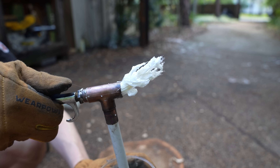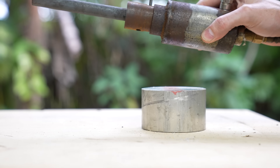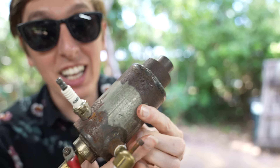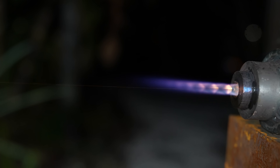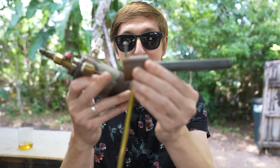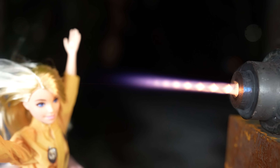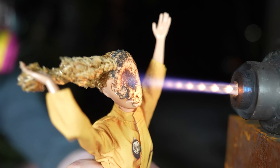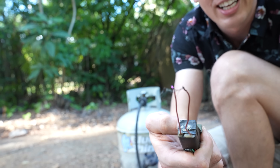The sugar kept freezing in the nozzles, so the obvious solution is to use hot air, right? Well, I've got the perfect thing for the job. This is a rocket engine I made for a video last year. The propane goes in this side, and the compressed air goes in this side, and then a 2,000 degree supersonic jet of fire comes out of this nozzle right here. The only modification I made is this tube that goes on the end of the nozzle. When I ignite the engine, the sugar should get sucked up the suction tube and blasted out of this end at supersonic speeds. You don't know how many tries it took for me to get that right.